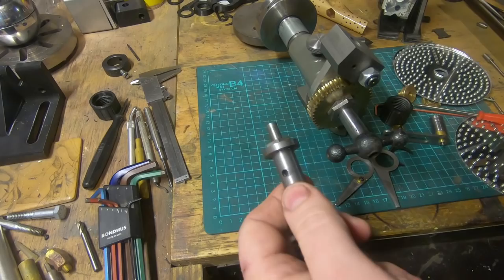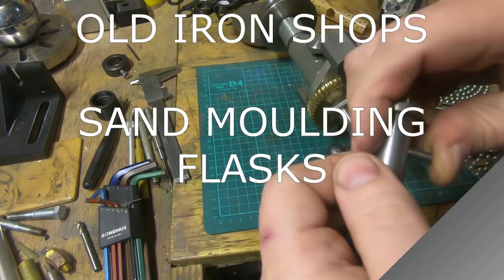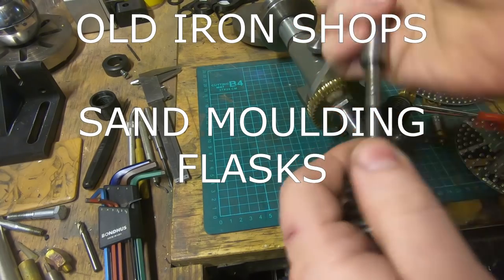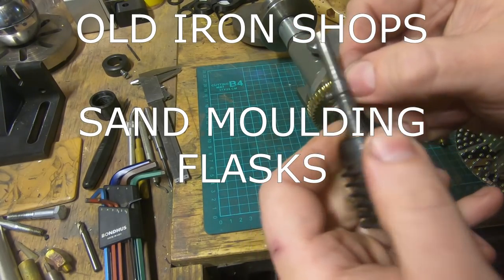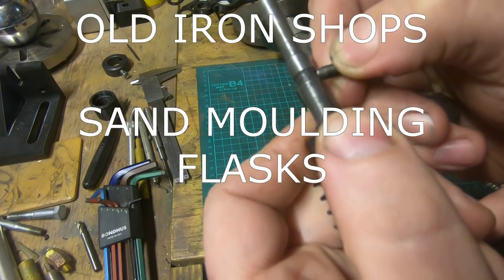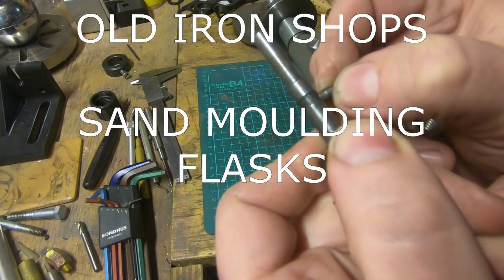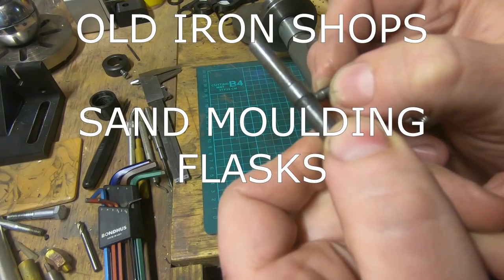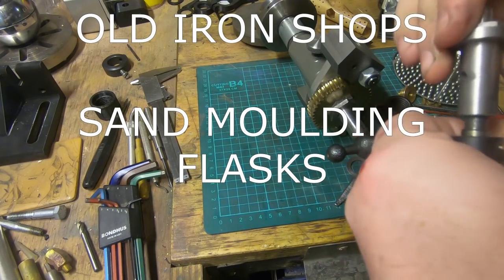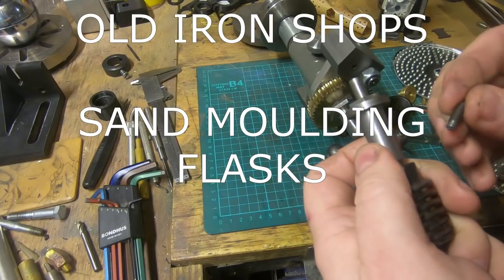You can see that little screw there — it goes in that hole and also locates in the slot on the shaft. It's not quite right; it's got a little bit of rounding and it's not quite deep enough. If we sit it in properly there's very little movement, and it was designed that way, but I might need to modify it a little bit. I'm going to take it across to the lathe, face the end off, machine it a little bit deeper, and see if we can get it to sit in there with no backlash.